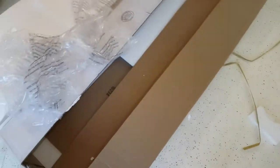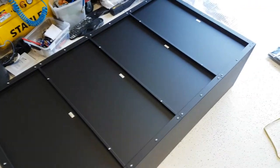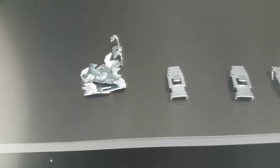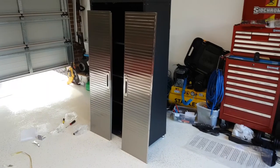That's both side panels, both top panels, and a back panel all damaged during transit because of those straps. Definitely get yourself a power drill because there are a lot of Phillips head screws to do up. Just make sure you leave the top corner screws free because there are metal corner protector bumper pieces that go on there at the end. The shelves are next — you get three fully adjustable shelves. There's a channel in the back and the shelf clips in using little plugs, and when you remove them you just push them out and those little tabs hook into the gaps at the bottom of the shelf.